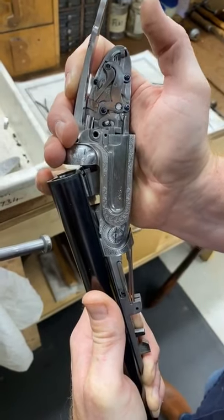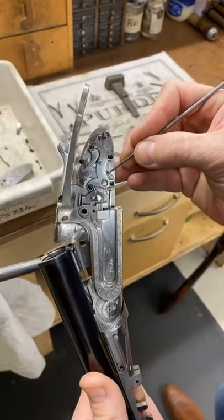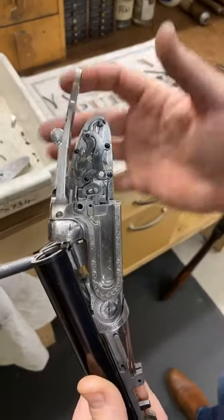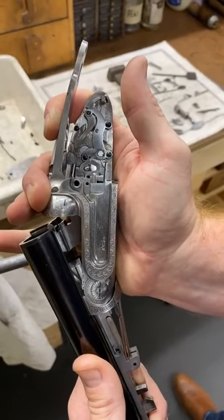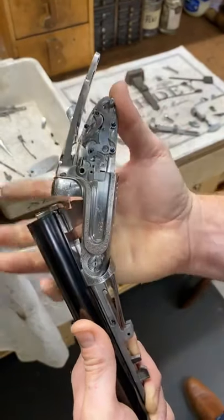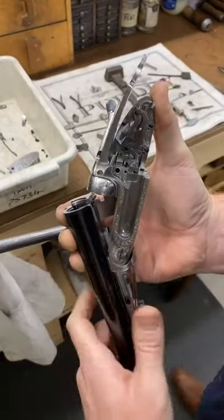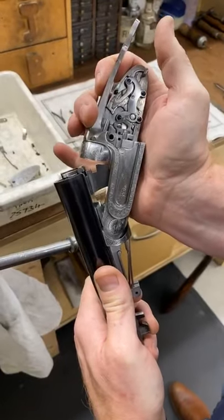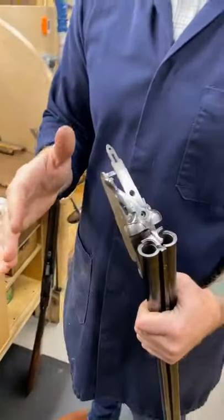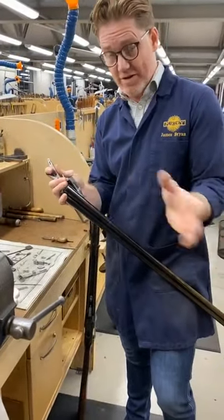I keep on going, and then here, can you still see it? This is where you're looking, which is the bent, and that's essentially when the gun's now cocked. So that lock needs to be cocked for it to fire again afterwards. So if I keep on going, the gun's still opening, obviously very slow. Right, so now that gun's cocked, the space between this cock and the full barrel's opening is where I need it to eject. So then it'll eject and then drop. So that's regulating for one side. You've got to do both sides and get them in time together.